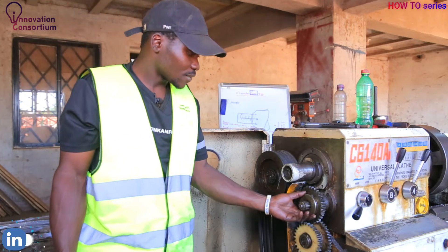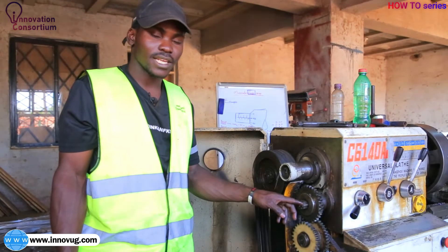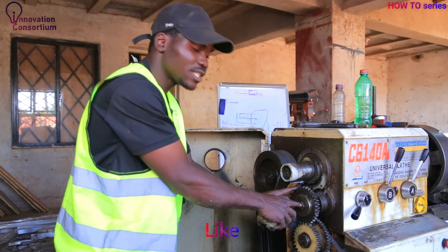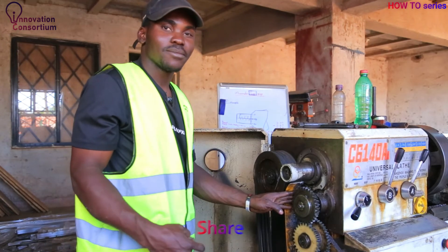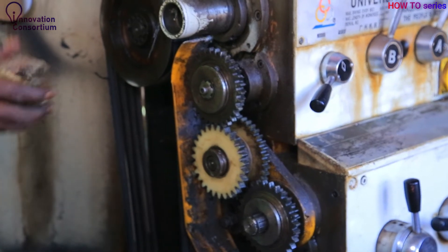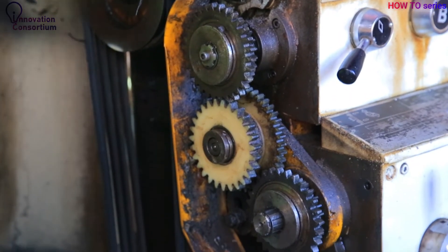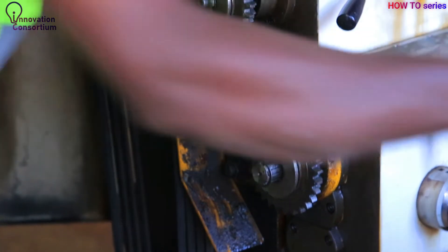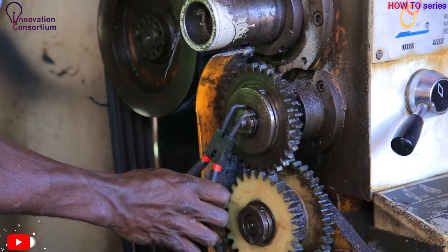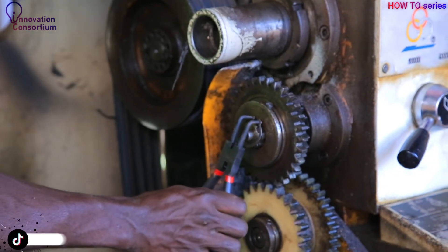Taking a physical example, we have this gear train of a lathe machine with an external circlip lock. We have a gear here — when I push or pull it outwards, when it reaches the circlip lock it won't get off the shaft; the circlip lock acts as a stopper. If I want to remove this one, I place the external circlip pliers into the holes, compress it — it widens — then remove it off the shaft. If I'm installing, I widen then push it onto the shaft.